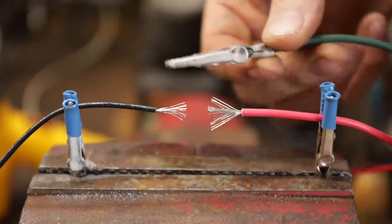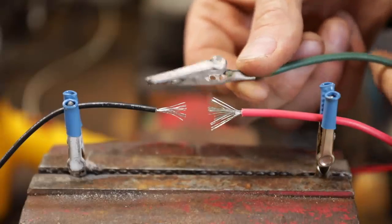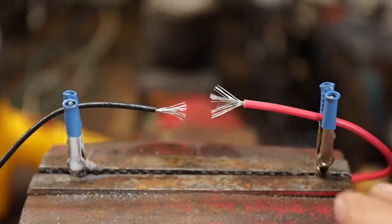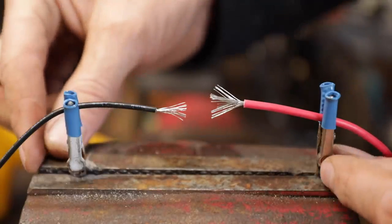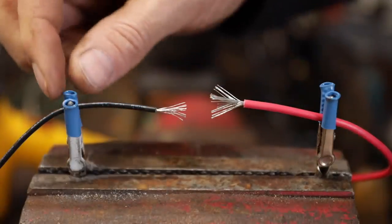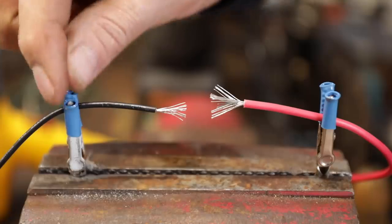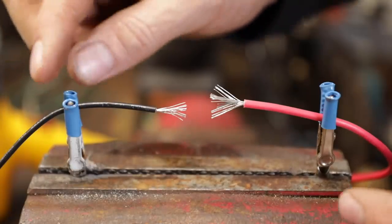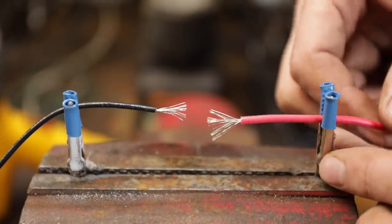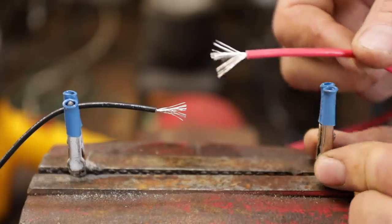Do yourself a favor and get a couple of these alligator clips. You don't have to have those fancy stands, you know, if you're just doing this once in a while. Take 2 alligator clips and clamp them in your vise like this. Now, some of these alligator clips have a pretty tight spring on them, so take some shrink tubing on the ones you're going to keep in your kit and just melt it on there, and that way they won't mess up your wire. And this is going to hold things securely, and you're just going to get a whole lot better job.